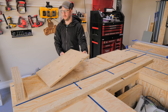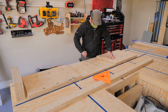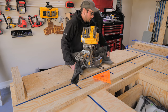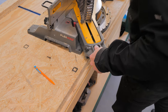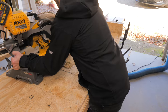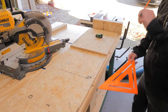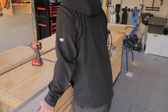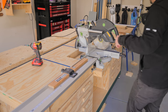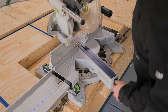With most of the pieces cut to size, I could move on to laying everything out. I started by placing the top panels on top of the bottom panel, then added my miter saw just to double check that everything was going to fit correctly. The space between the top panels was a good fit for the saw, but I did need to mark out where the miter saw would contact the top panels when turned to its outermost miter positions. I marked out these areas with my speed square, and then I could get my miter saw set back up to make the angled cuts in the top panels. I made both of these cuts at 45 degrees, even though this Dewalt miter saw will swing to 60 degrees in one direction, and this was just for ease of assembly.